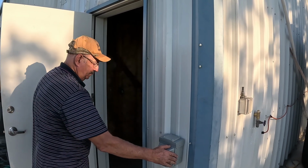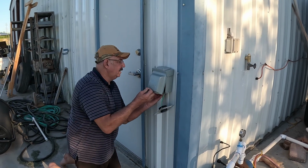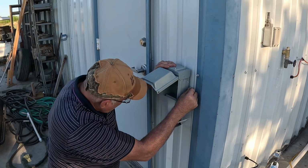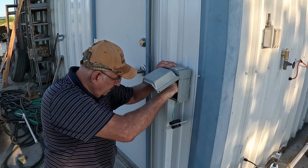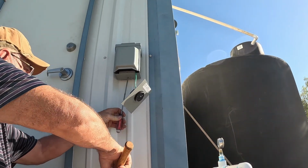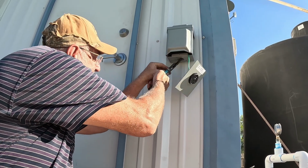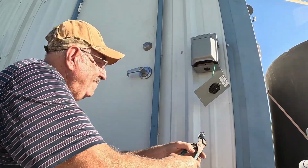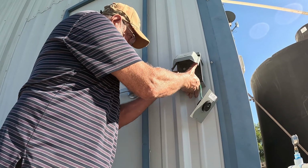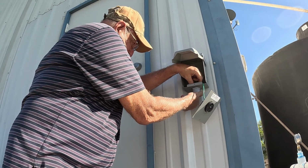Now that my fan club has left, we can get back to work. It's just a matter of putting in bolts with spacers I made by cutting off small pieces of PVC pipe. Now that I have the box securely mounted, I can remove the knockout from underneath. Then, through the hole, I can add a PVC conduit male adapter, followed by a short run of conduit pipe and a 90-degree L with a cover to help running the wire through the wall.